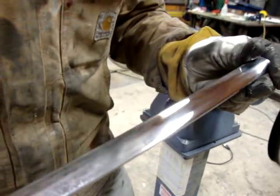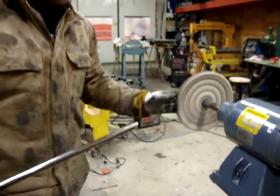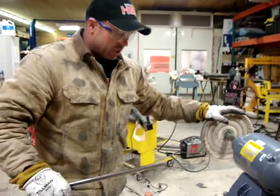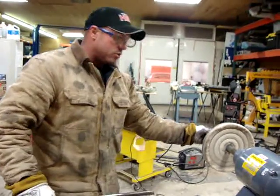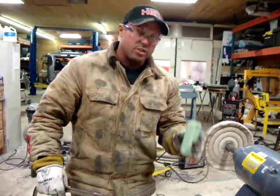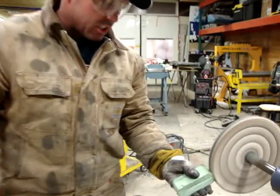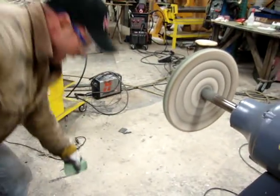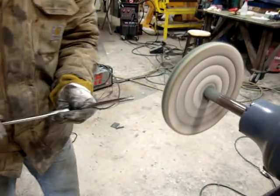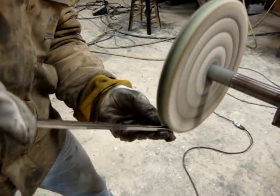You can see I've got a pretty good finish — this is probably like a mirror already. Now I'm going to go ahead and go to the loose wheel and use the green compound. This green compound is just for stainless. I've already cleaned this wheel up, so I'll just load it up with some compound. This movement I do not cut at all — it's strictly a finish movement. The wheel is spinning this way and I'm only going to go this way.